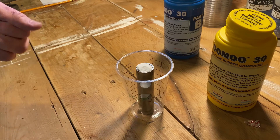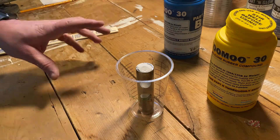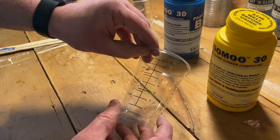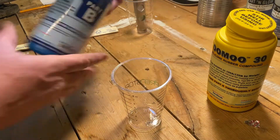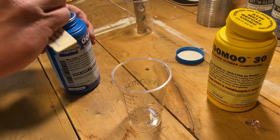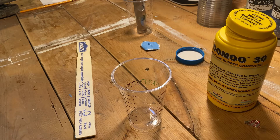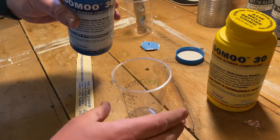Now I think I'm ready to mix up some molding compound and get that poured in. I've never actually worked with this before so this will be very interesting. The cups are nicely graduated so I know exactly where I'm going, and I'm going to mix up an entire cup of this substance — I believe that will be about the right amount. It's a two-part compound, similar to an epoxy, where you mix two parts together and then have a limited time to work with it. You get 30 minutes in the pot, and it's fully cured after six hours.